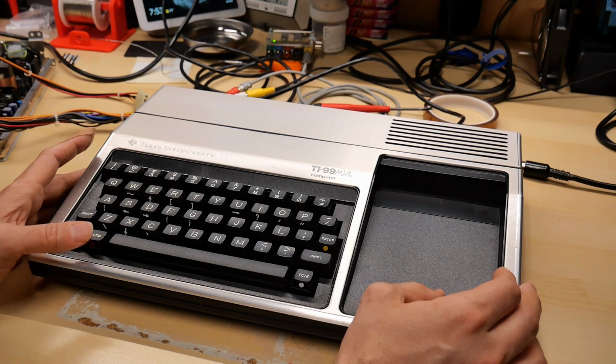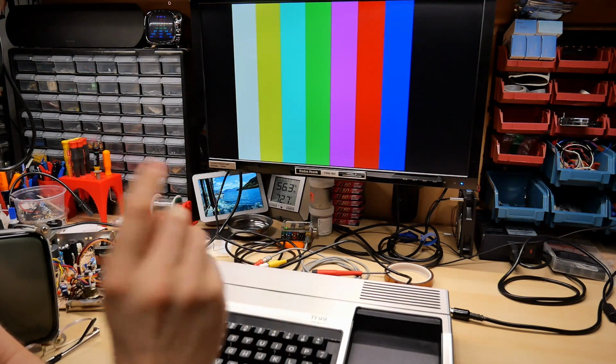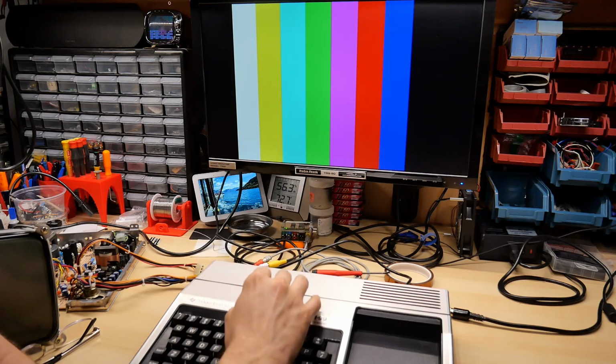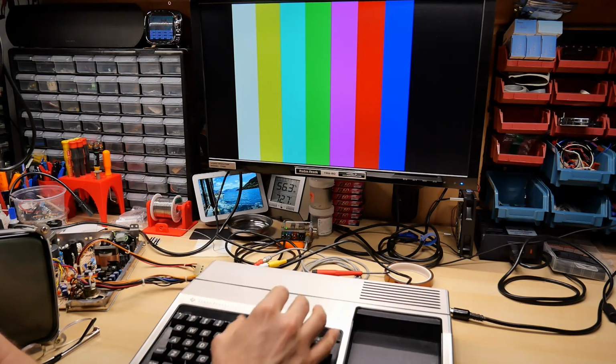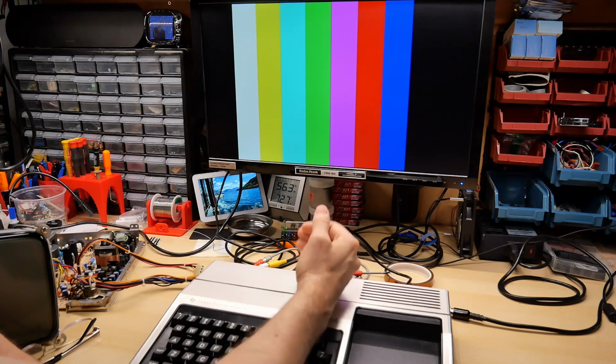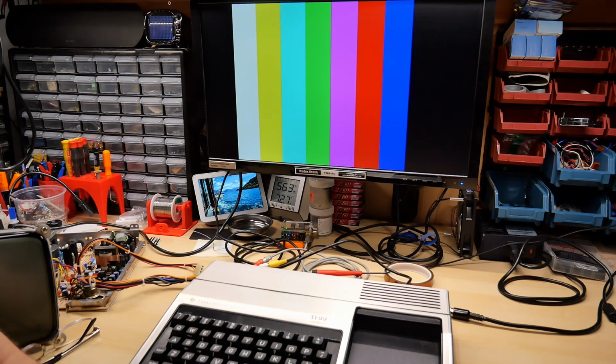And if I turn off the computer and I turn it back on, listen for the sound chip coming on, making those tones, and then getting initialized by the CPU, which immediately turns it off, and then you'll hear the system beep. This was a process described in the startup sequence from the technical PDF that I was looking at. Take a listen.